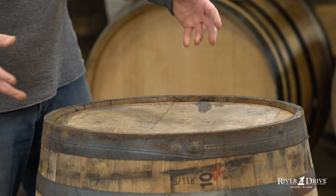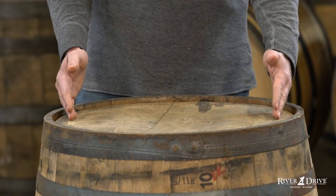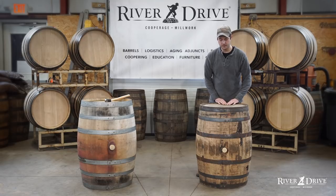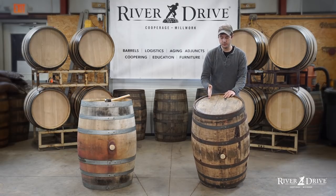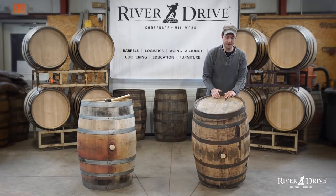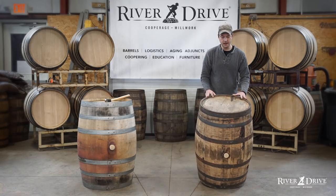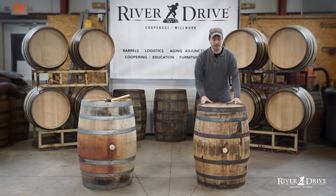The heads of these barrels, as we know from our anatomy videos, are made up of many different boards held together either with tongue and groove or dowels. On our barrel inspection we want to make sure that the boards of the barrel head are all going perpendicular to the bung stave — again, this is just the proper way to cooper a barrel. Generally, if a head is crooked or off, the barrel is still probably going to work, but it raises questions as to why that head was messed with or not put on properly.